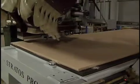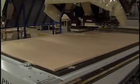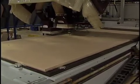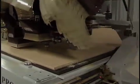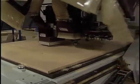What it's doing right now is cutting the stretchers for the top of the cabinet. It's putting the dados in. This is a 48-inch wide base cabinet. 2 stretchers on top, which are the 2 that just had dados put in. This is the bottom of that cabinet. There's going to be a bank of drawers on each side and a regular cabinet in the center.